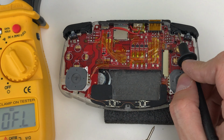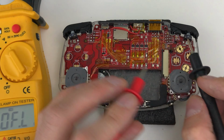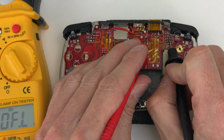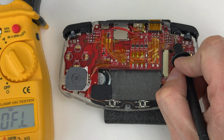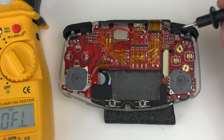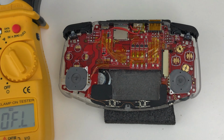Then R2, I can just run this over to number 43, I think, because we have switch 1 on the add-on board. It's connected to 43. So I'll just run the button to 43, and then on the back I'll do the same thing with the ground. I'll just run it to the ground for R1.